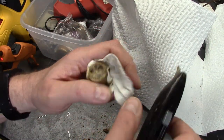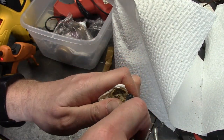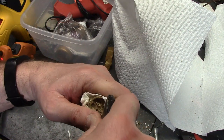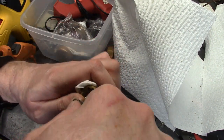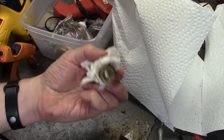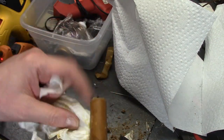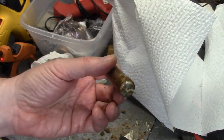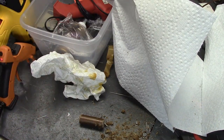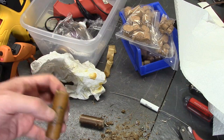Later caps — they started using more and more stronger methods of sealing the end, like epoxy or a Duramold type. Those are really, really tough to get apart without destroying the capacitor. Their thinking was that if they sealed the environment then moisture couldn't get in and the caps would last much longer. The reality is that the type of paper they used contained acid apparently, or other impurities, and they degraded regardless of the environment — so that's why these are essentially always bad now.